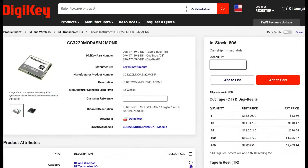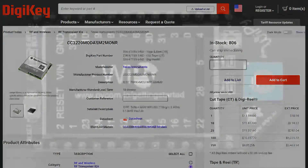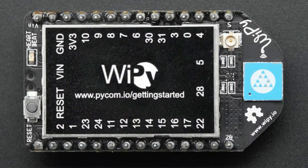The next one was the CC3200, and what was neat about it is it could actually run code on it. It changed from the original CC3000's 8051 to a Cortex-M4. So you saw boards like the WiPy, which was an all-in-one CC3100 or CC3200 with a sticker on top. You could run MicroPython directly on it, which at the time was a pretty amazing thing. That was the original Pycom.